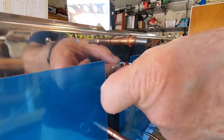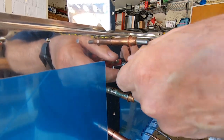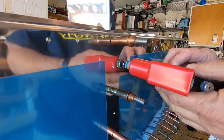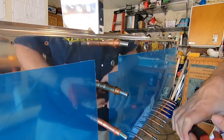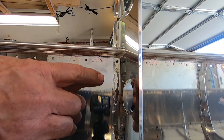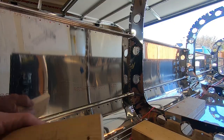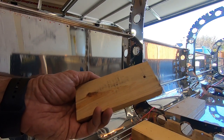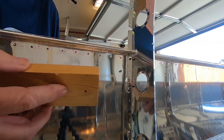Time to install the SD42BSLF pitot blind rivets. The problem with these pitot rivets is the mandrel is almost always left inside and must be removed. I picked up a scrap piece of wood and drilled an enlarged one-eighth inch hole into it so the pop rivet would go inside.